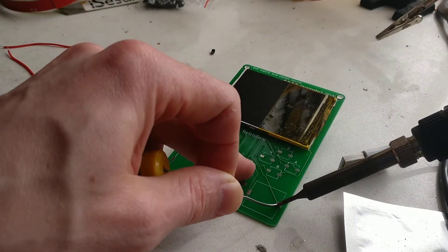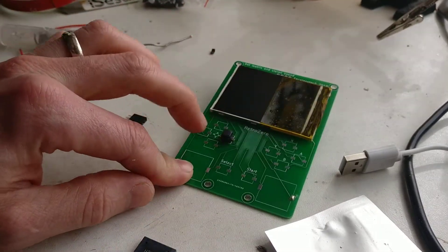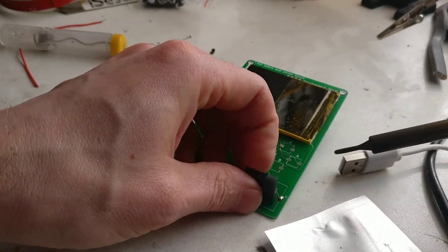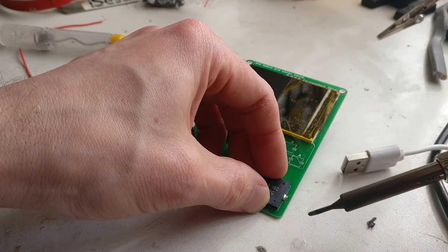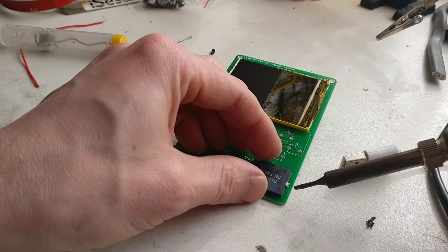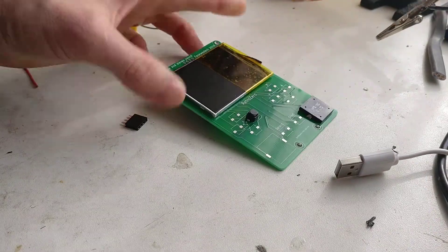It's gonna blob - put a bit of solder on. If you're making this kit with this board, you can only put the right side speaker on, because if you connect the left side speaker you have all sorts of issues, which I'm hopefully going to remedy in a future build. Again, just line it up, heat the solder, get it into roughly where you want it, let it cool, have a look. If it's a little bit skew, move it around, and once you're happy with the positioning, just blob the solder on the other side. That's it - it's secured in place, jobs are good.